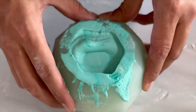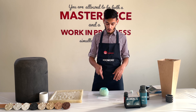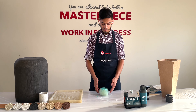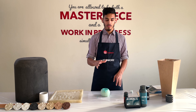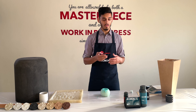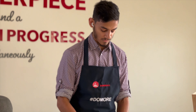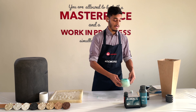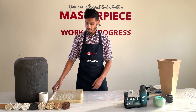Our casting is done — you can see how simple it was. You also have a longer pot life compared to AC100. The cure time is about four hours; because of our weather conditions it might even cure in two and a half to three hours, but if you're trying it out for the first time, a safe bet is to demold after four hours. I'll set this aside now and move on to the next casting — this rectangle that we use for wall panels.